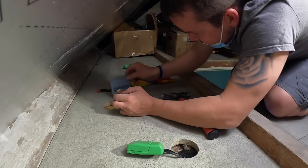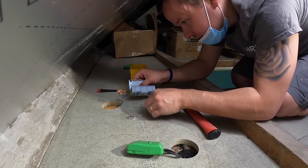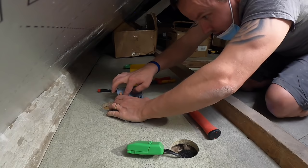And I like these little through light boxes. They're the Wago light boxes. So that will just sit there. Look, we can screw that. Well, they give you these brackets, little single bracket with a hole. You can screw that down. He'll run into there. Like that. One, two, and three. And then we'll run our new cable. Obviously, I've got to put some sleeving on there and put a connection on that.